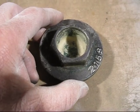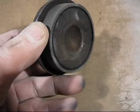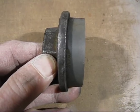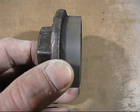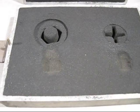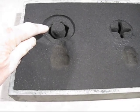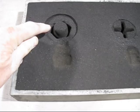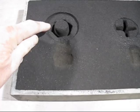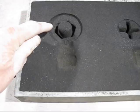This is what I've got to cast today — it's a cast iron cap with a deep pocket in there. I put a PVC sleeve on there to give it draft, as machining allowance, and then I can cut the thread afterwards on the finished casting. Here's the mould and there is that deep pocket — it didn't break off. I like to pour them downwards like that instead of upwards, as they may break. This one still may break, so I'd better not count my chickens before they're hatched — we'll see what happens.